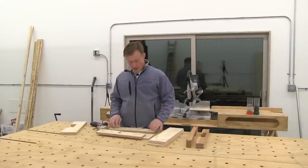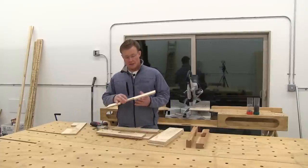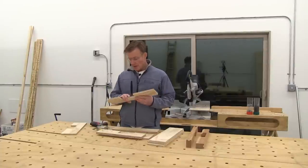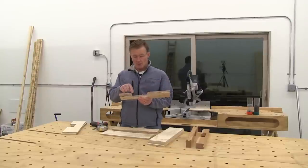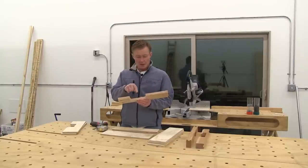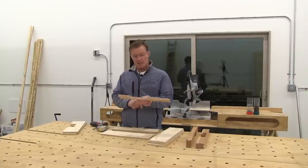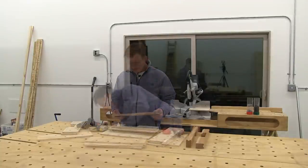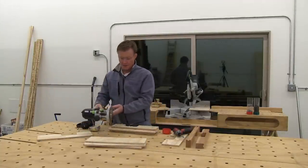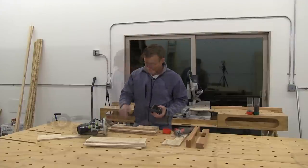I could drill the holes and use a jigsaw and cut out each one of these individually, but rather than doing that I took the time to lay out what I needed, took a 3/4-inch paddle bit — spade bit — drilled the two corners, took a jigsaw and connected the dots and created a nice little pattern out of some scrap 3/4-inch ply. And I'm using my same half-inch up-and-down cut spiral cutter with a template.